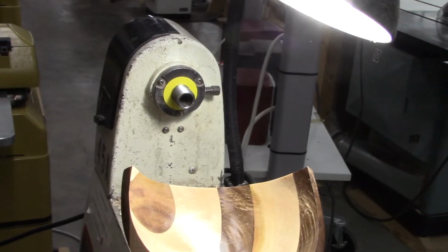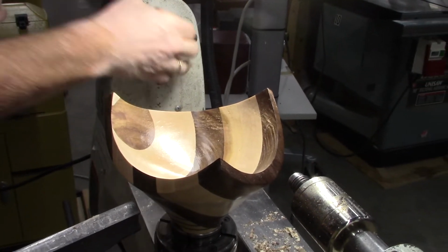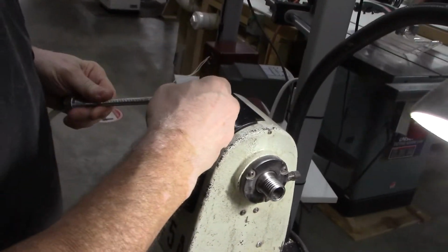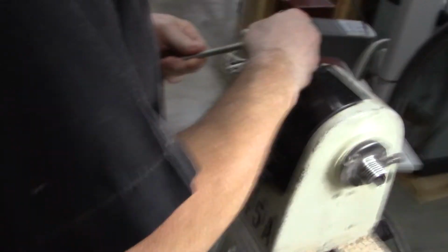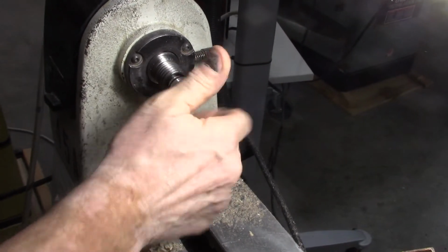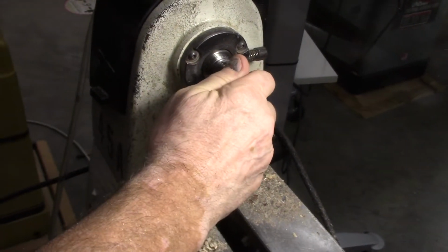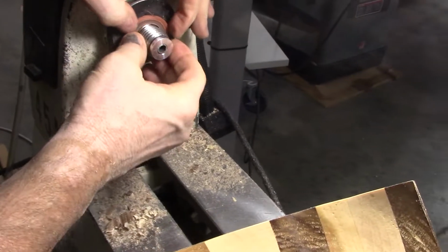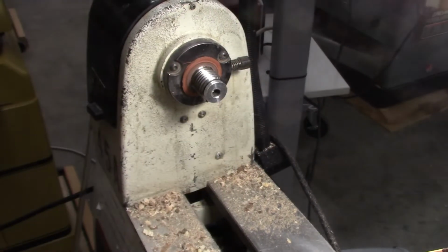And this is how you can use the chuck. We have one for this lathe, and we also have the setup for the Powermatic lathes as well. There's a little O-ring here, and it's important to get that O-ring seated. You don't have to kill it, you just have to make it snug. After that, there's a gasket. There's a one-size gasket for this, and one size for the other lathes. There's a shoulder on the headstock, so make sure you have that gasket on the shoulder.